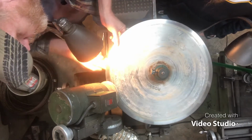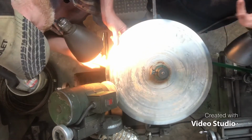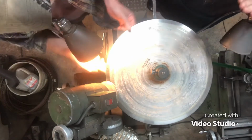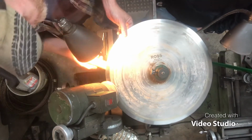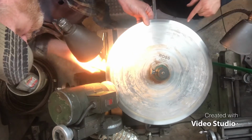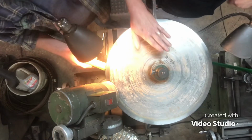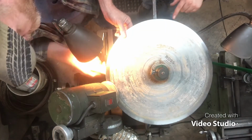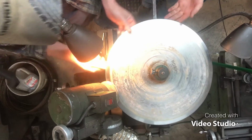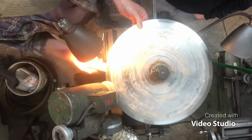And with that grind on that side, and this being the bottom, that edge, the only thing you're working on is this edge. Right, so that's what's gonna cut. And that edge is gonna help push everything under the table, the scraps. And the only thing this side of that blade's doing is pushing that meat into wherever they want it to go. That's why you want that grind on that side, not grind the other side, right? Yeah, you want that top side flat. Yes.